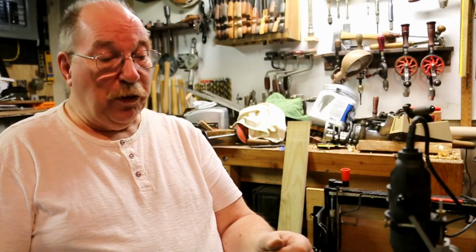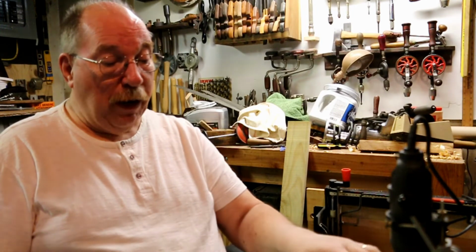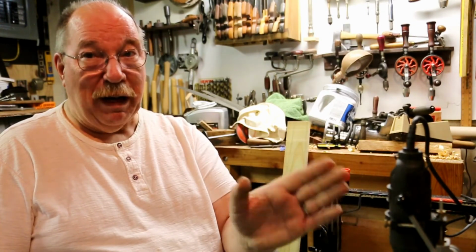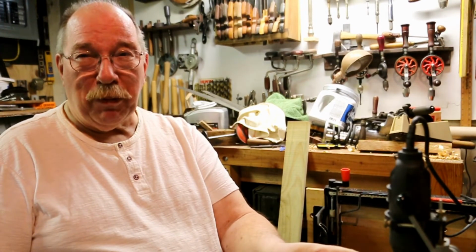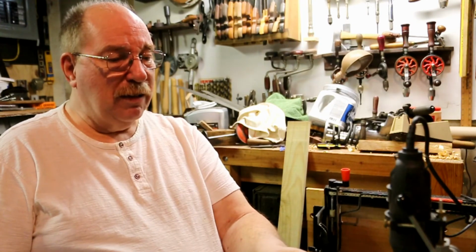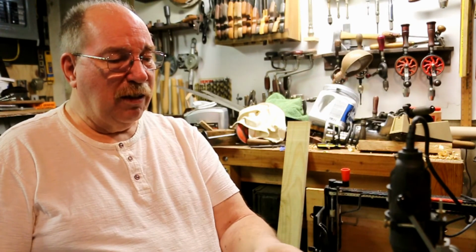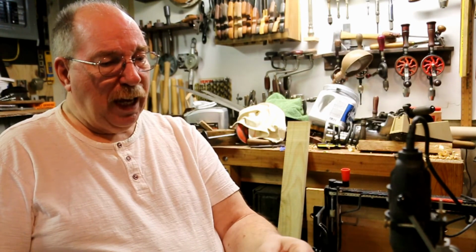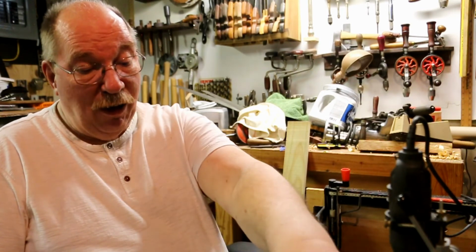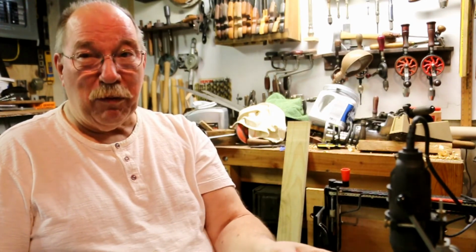Well, I think the little drill press is going to be doing quite a good job taking care of the small stuff. I think I'm going to mount it to a wooden base so I can clamp it a little easier. And I have an extra Dremel tool that I'll just leave mounted in it, because that way I won't have to be adjusting it back and forth. I still need to come up with a better bushing. I probably have to make one up out of something. Maybe turn down a piece of plastic that'll fit around the barrel of the Dremel and clamp up in this little banjo fitting there. See if I can't get that to work. But I know now that it's definitely going to be strong enough to drill through a piece of steel. It'll drill through nearly anything that I'm going to want to drill a hole through.